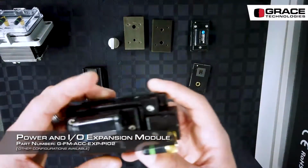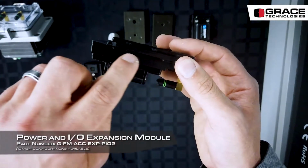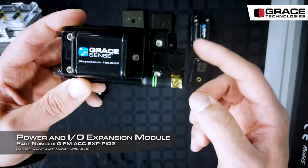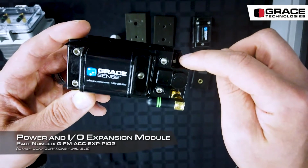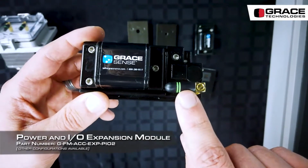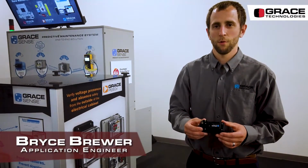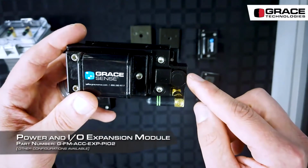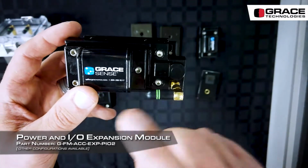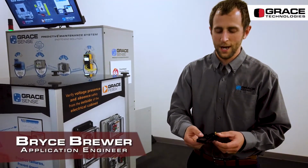And then our power and I/O expansion modules. So this device is actually the center one here. The battery mounts to the top, and it sits on top of our vibration and temperature node, which you can see the LED right there coming through. This option has a coaxial connector, which can be used with this type of antenna cable, but this can be removed and a remote antenna can be ran through that guarding. Other options include an M8 connector, to where you can power the device using 24 volts instead of the battery. Here's a quick look at that just by itself without the battery and the node attached.